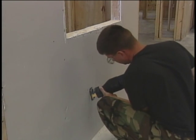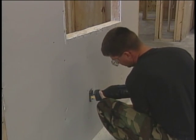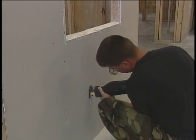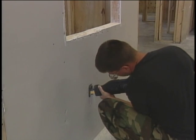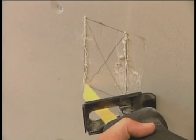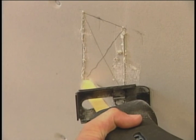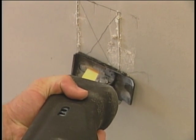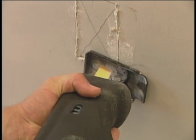Bring the blade up to full cutting speed and slowly tilt the saw downward until the tip of the blade starts cutting into the material. Gradually lower the blade into the work. After the blade penetrates the material, tilt the saw until the base assembly is flush with and perpendicular to the cut.